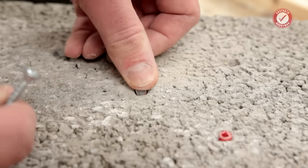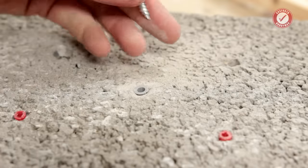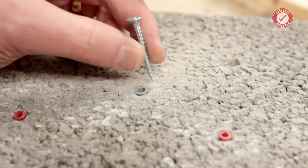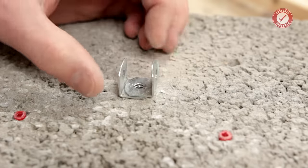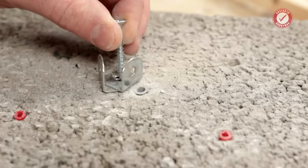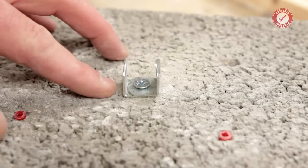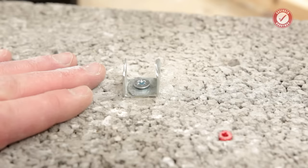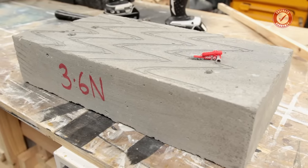Shove the plug in and give it a little tap with a hammer so that top rim is flush with whatever you're attaching it to. Because this is a Test Tuesday, I'm going to attach a bracket onto this block. If you're using a bigger screw — I'm using a 5mm screw here, which is the biggest it recommends — you might find you want to use an impact driver to put it in. And that's it — that's into a concrete block. This is a 7.3 Newton concrete block. We'll also try it in a low density block, like a thermalite type thing. This is a 3.6 Newton thermalite block.